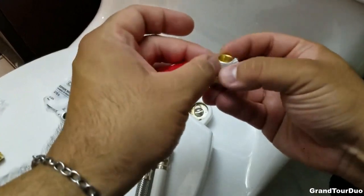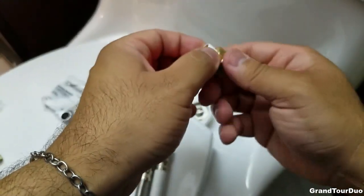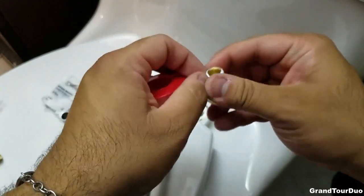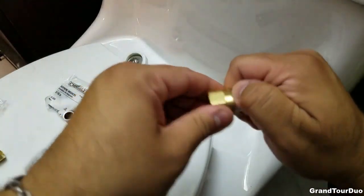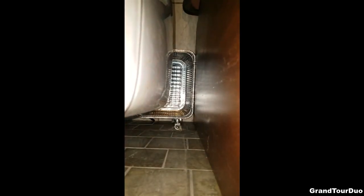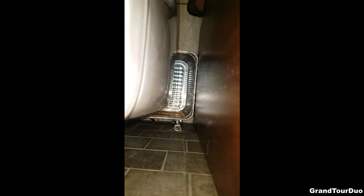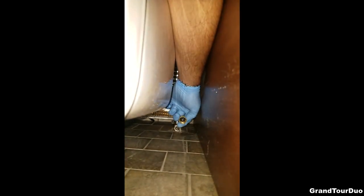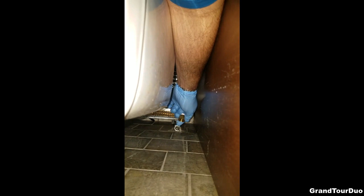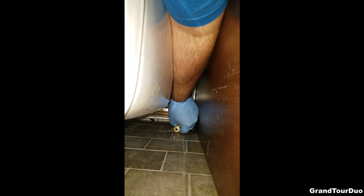Same thing with the piece that's going to go on the main line. It's also important not to fully assemble this before attaching it. I prefer to attach this piece first to the main line. It was very hard to get the Teflon tape in that area — they do have some gels or paste you can use instead, but that makes it a lot harder when you plan to remove it. Also, wear gloves. Although this is clean water, I always prefer to wear gloves for most plumbing jobs, just in case.